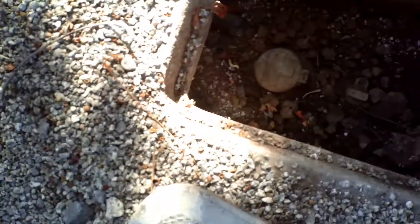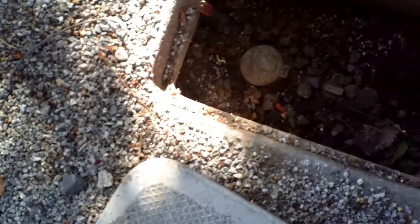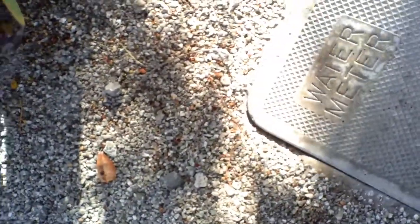I'm going to turn it back on because we need the water on in my house — can't keep it off. But that's the way to shut off the water. It's very easy, it's very quick, and it works every time. So I'm going to put this back over, and that is how you shut off the water in the house. For any leaks, come out, find out where your water main is, shut it off, and that'll prevent future water damage within your house. That's something you want to avoid. Thanks for joining me — join next time and I'll go over more fire safety tips with Firefighter Caparata. Thanks again.